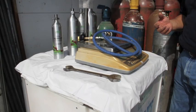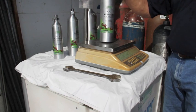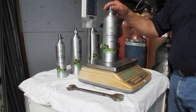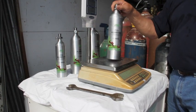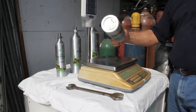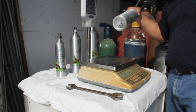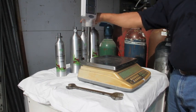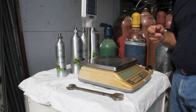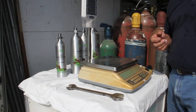The next part of this procedure is to get to filling. One of the things you're going to have to do is determine the empty weight of every cylinder that you fill, and determine the quantity of CO2 that it holds. We take our scale and weigh the empty CO2 cylinder — which is 2.12 pounds — and we write it on the bottom of the cylinder so that information is permanently there. This cylinder holds 1.5 pounds, so 1.5 plus 2.12 is 3.62 pounds, which should be the full weight.